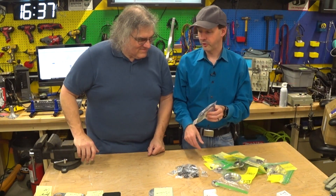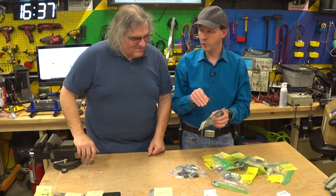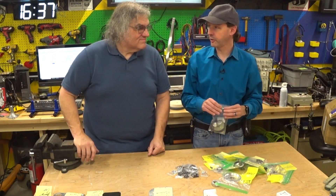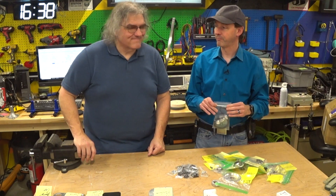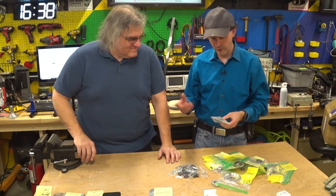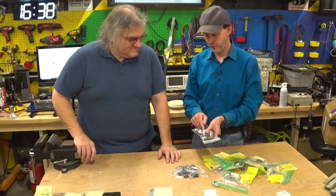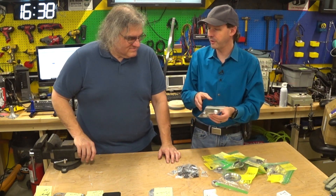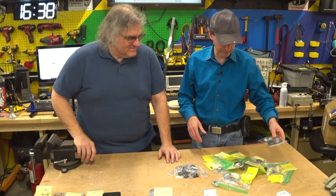I've got to broach those with like a three millimeter broach. I don't have my own arbor press — which is hilarious, because when we were going on a business sale I sold like three of them and I don't have one now. But I know people. I'm going to try and broach that, or I might just do it with a file since it's soft aluminum and it's like two to three millimeter broaching.